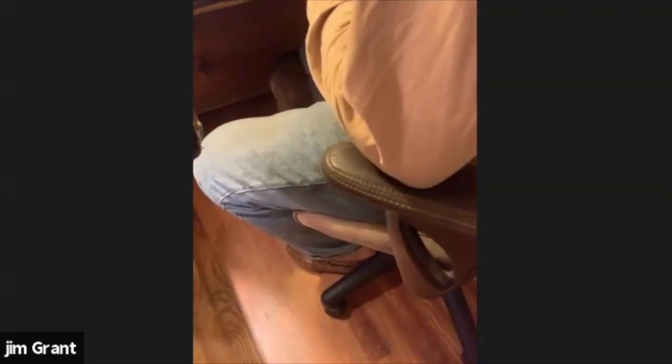And it was really helpful to see the other difficulties that the other participants had. Yep. Because then I know, okay, that can happen, so watch out for that, although I'm not exactly sure what's going on. This is completely doable. They're all solvable problems. Yes. And especially if you've got an old machine, I don't mess with old needles ever. You always put new needles in, they're just not going to be worth it. There's only 2 adjustments down here, 1 adjustment there. So there's not a lot to adjust. You just got to put the time in.